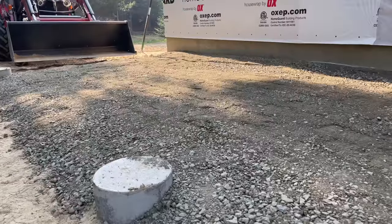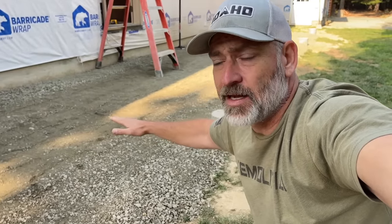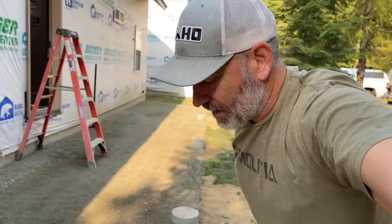That was a lot of work this morning getting all this gravel down. Why are we doing this here? There's plastic underneath it - that's to help keep moisture from coming up out of the soil to the bottom side of the deck. This is going to be an eight by 57 covered front porch, and we want to try to keep the spring mosquitoes down. We want to keep those mosquitoes down and not give them a moist, cool, dark place to hide in the spring and early summer.